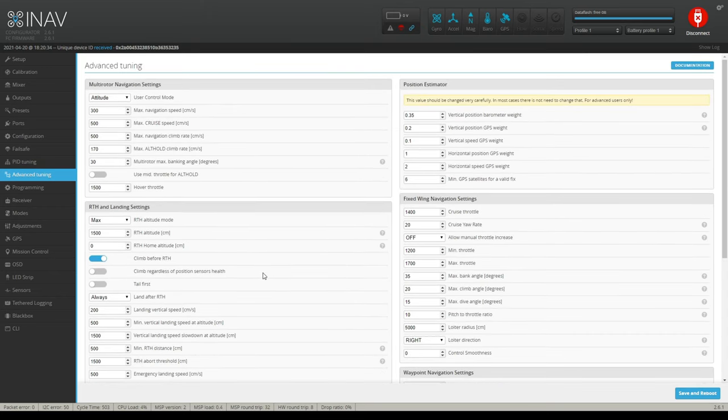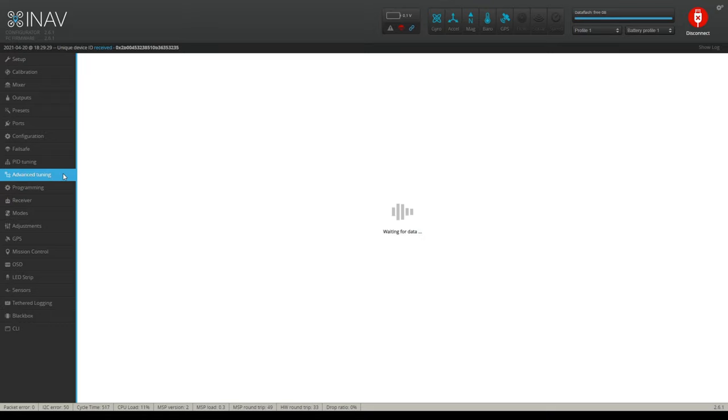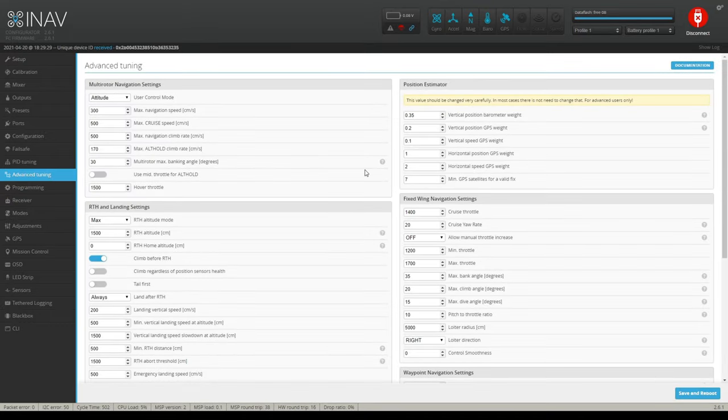I'm not going to go through every single one of them. It's the same thing over here. I mean, minimum GPS satellites for a valid fix, 6. That's important. And actually, I want that to be 7. So I'm going to go ahead and change that, because 7 should be the minimum, not 6. So let's go back in here. And what I like about INav is when you do a reboot, it goes right back to your screen. I like that. It's really convenient.